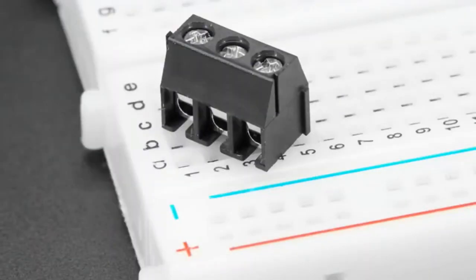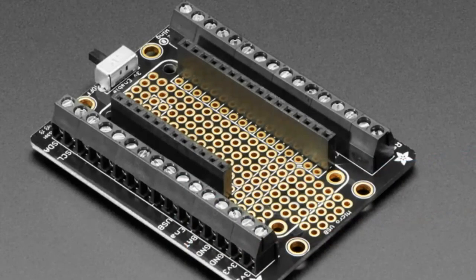The standard terminal blocks, again, like I mentioned, have the screw terminal top. But first off, sometimes they're Phillips, sometimes they're flathead. You have the wrong one or you have the wrong size. You can easily strip them. It's sometimes also possible to insert the wire into the rising part of the terminal block, so you think it's connected, but it's actually not. It can come loose. Basically, you have to have the right tool for them. That said, we do use them a lot.